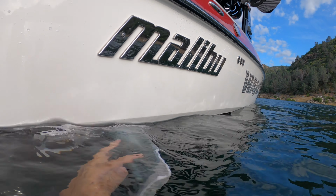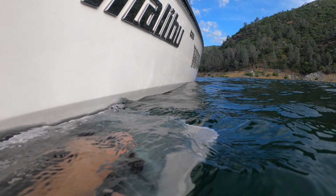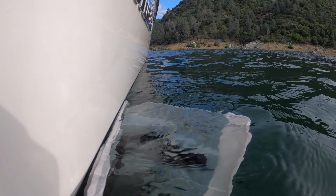And two, I want to talk about this because I actually dialed it back just a tick more than I originally thought I was going to do. I'm going to kind of show you here, if you can see that. So it's probably about an inch and a quarter out from the minimum. And even with these guys with the Swell set gate, when they designed this, they didn't design it for bigger is better, because it's not always better on every boat. If I had a 24 footer, this is a 21. If I had a 24 foot boat, bigger might be better, but it wasn't on this one. This adjustment right here was the best, okay?